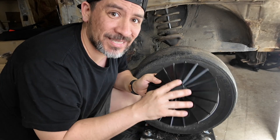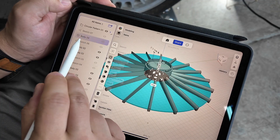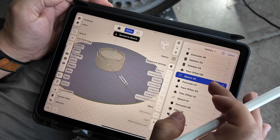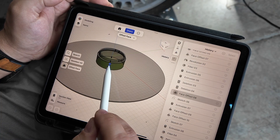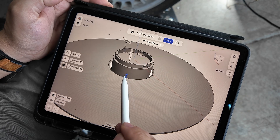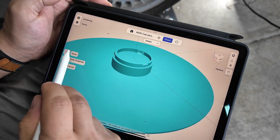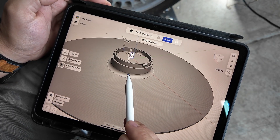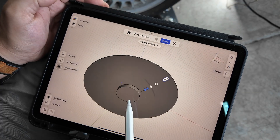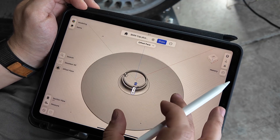So I'm going to redesign this to remove those fins. One way to get rid of them is opening up the items, selecting the circular pattern, and just hitting delete — and then the fins are removed. We can also use the history function to find the offset we created earlier and change it. The whole design changes once you make one specific change within the history function. I also want to add a fillet, but I have to combine the parts first in order to do so, which gives this part a bit more strength as it connects from the cylinder to the actual disc portion. Then you just have to remember to go back and clean up the bottom of the file, move it up, and make sure everything prints out completely flat with no overhang or supports required.